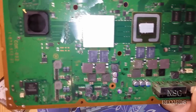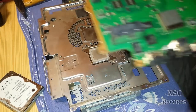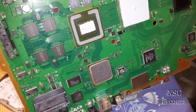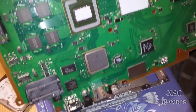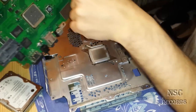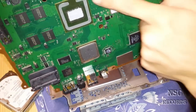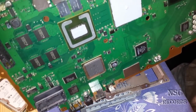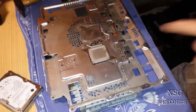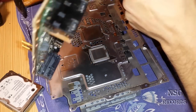I will now just put here some thermal compound and record it. I have just applied new thermal compound here. On the CPU side I have already done the new thermal compound. I will now put it together. Don't forget the position — look at the silicone where the marks are, and if you can see it's up, then you will need to put it here up as well. Here you can see it's up, and we will put this now together like that.